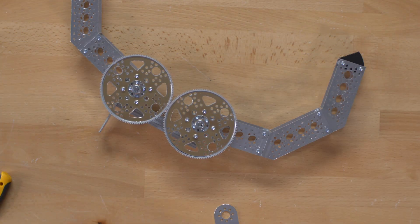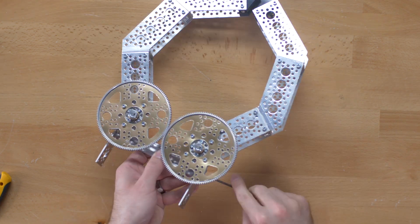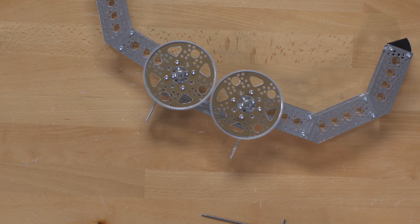But if you're doing it along channel, you need to make the math work out. 128 plus 128 isn't divisible by 48, which it would need to be if you wanted these gears to mate properly with each other.